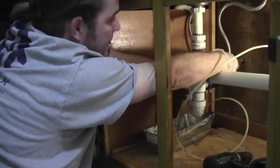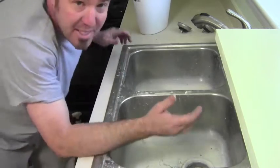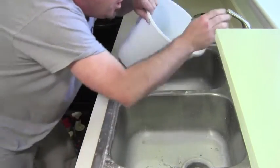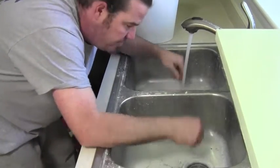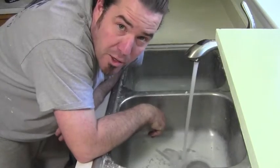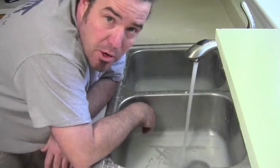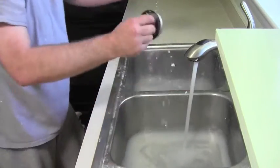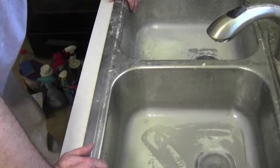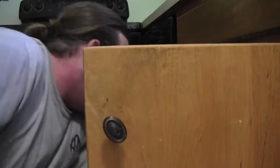I'm feeling pretty good about this one. So I have a super gross sink here. After we know the plumbing is all buttoned up and it's not going to leak, this is my method: I like to run hot water and only run hot water. Fill up both sinks with hot water — double pull, double flush. You never want to use Drano ever. It's the biggest scam. The only thing it's going to do is corrode your lines or burn up the guy who has to come snake it out. Check for leaks. We're looking good.